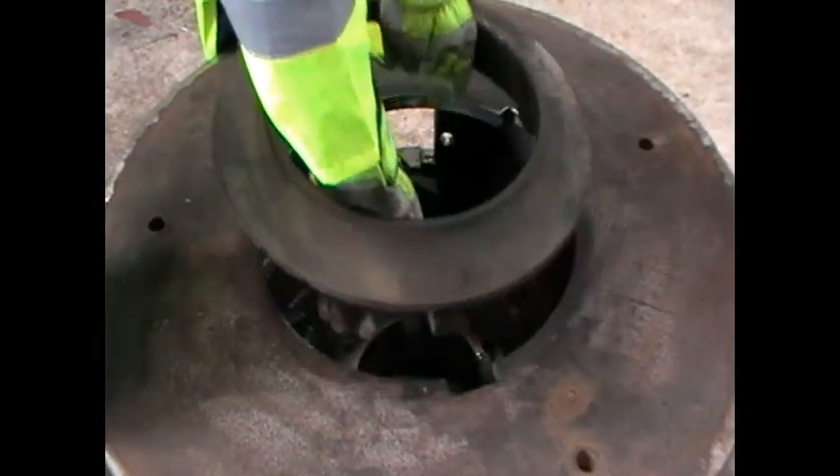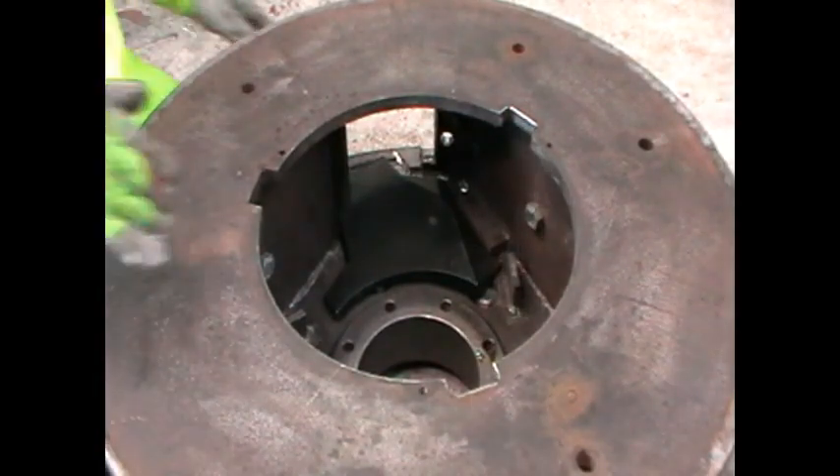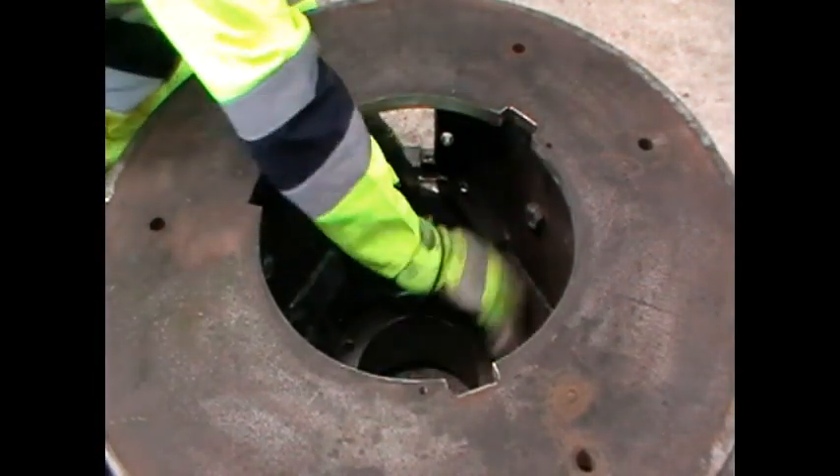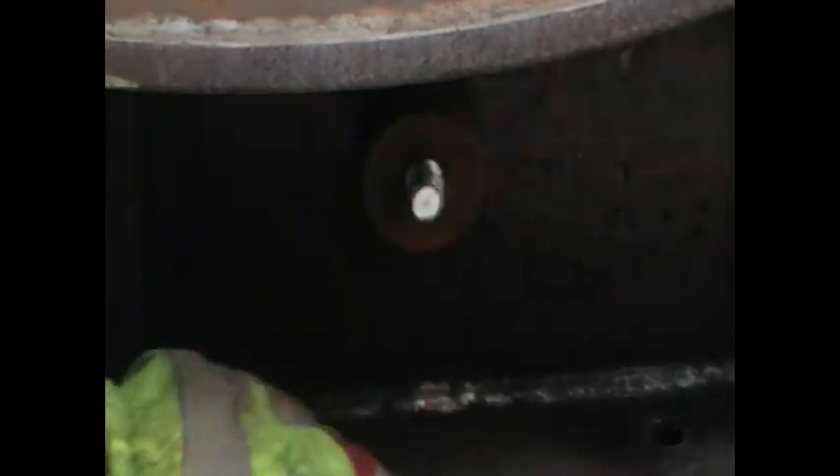The rotor needs to be as clean as possible. This means removing any fitted wear parts and the removal of any build up or weld splatter. All balance weight should be removed from the rotor — only the balance bolt and nut should remain.